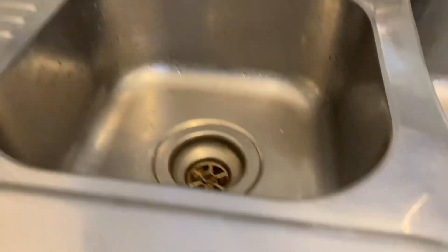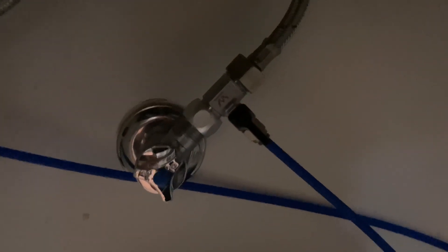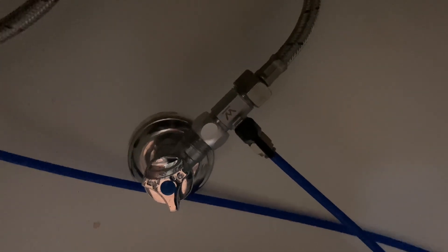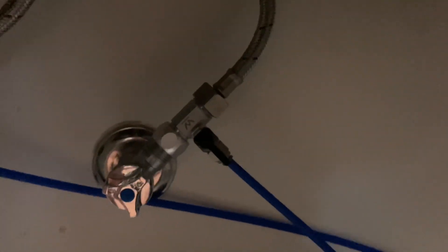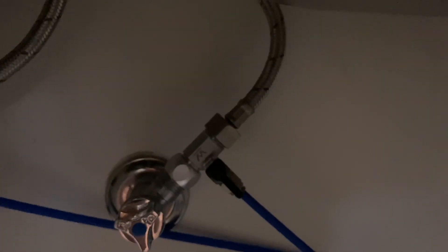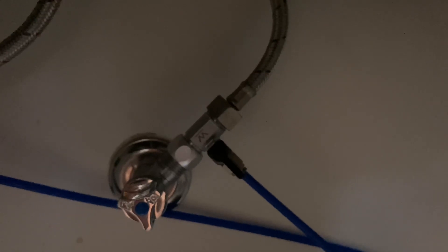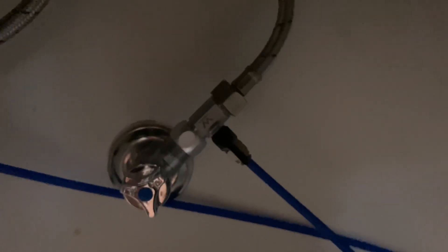Once you do that you need to find your water source, so we'll go down under here. The water source was the tap where the water comes into the sink supply. You can see there's a little T-piece that he supplies — see that one there with a W on it. Basically remove your flexible line carefully; it's a 24mm, or in plumber sizes that's a shifter. Make sure the seal's still there and in good condition, put the new T-piece in, and then you've got your little bypass.